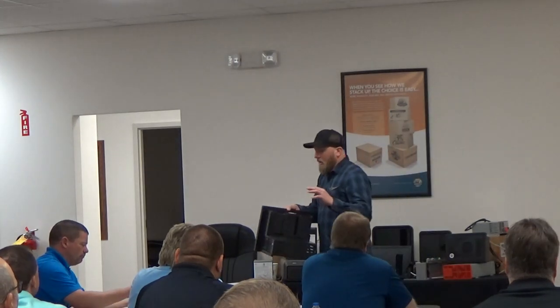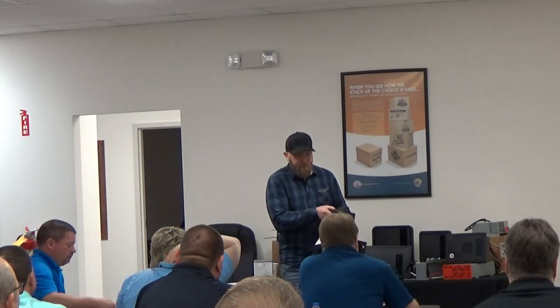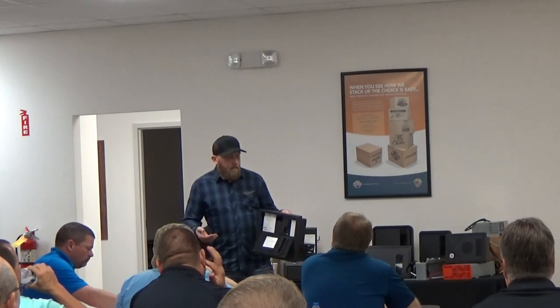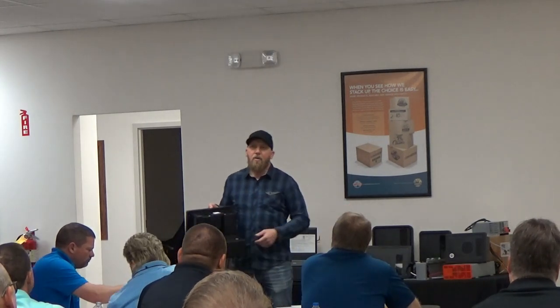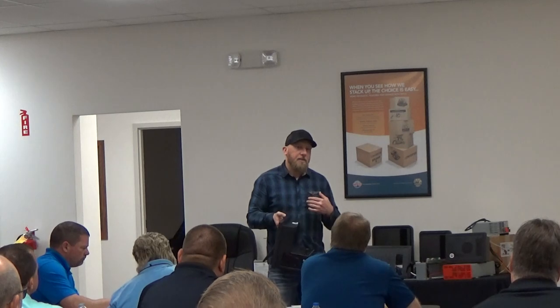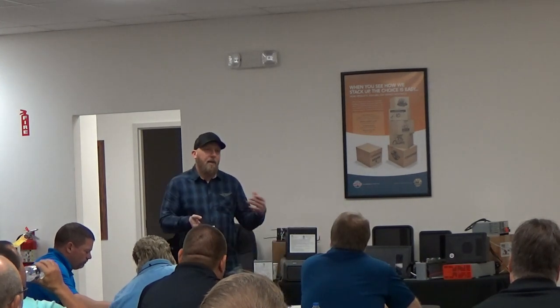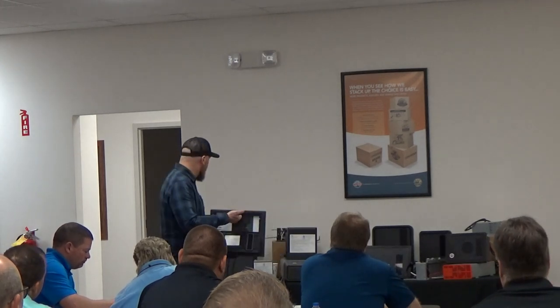These are pretty resilient, so a short spike won't really do much every time. Not every board is built the same, so one may be more tolerant than the next. It's usually prolonged surges, like if they plug into 220, or a lightning strike, or power goes out and comes back on. We'll take these out, and it's very easy for us when we get them here to tell if they had a power surge, because there are some components in here that, if they fail, we can tell most likely they had a power surge.